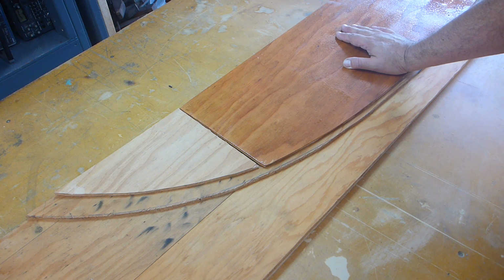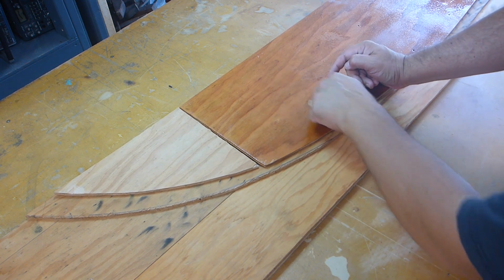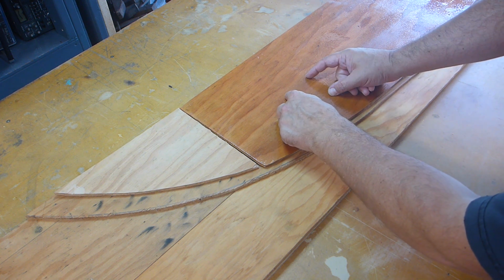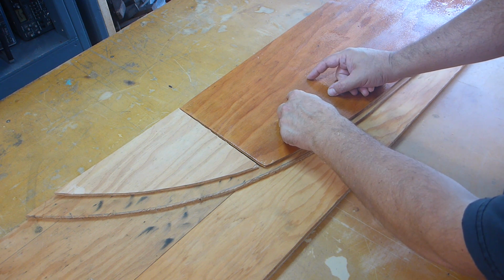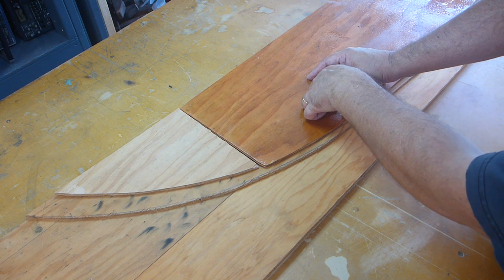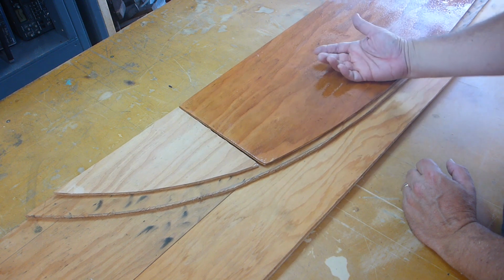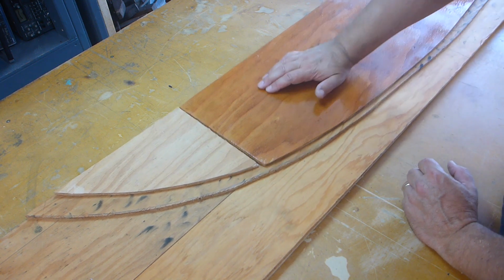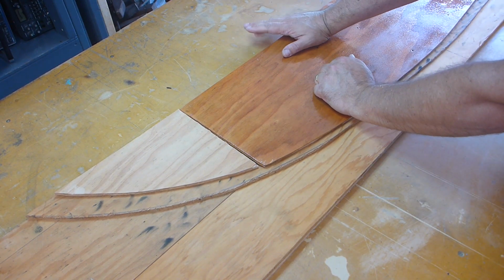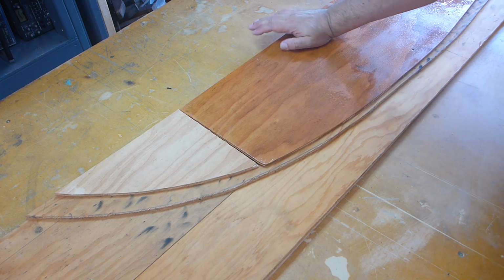The idea down the road is I would actually cut into my transom either a V going all the way to the top, or just an abbreviated one, sort of a trapezoid, that the outboard would be able to clamp right onto, and that way I'd access the motor from inside the cockpit, which is ideal. So having an inch thick reinforcement is not at all over engineering in that scenario. So I think that's what I'm going to shoot for.